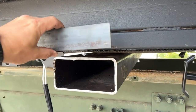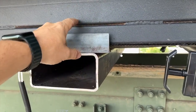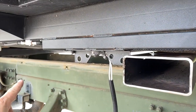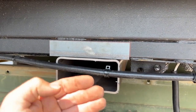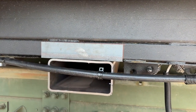My plan is to mount with some angle iron these channels to the frame of the camper. Once those are mounted to the camper then I can straighten everything on the truck chassis and get the camper straightened out. Angle iron is in place. The channel has been centered both this way and this way, ready to make a bead across the top to hold it all together.